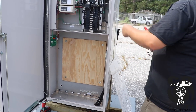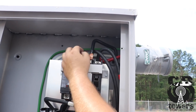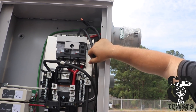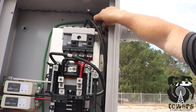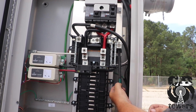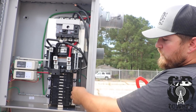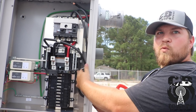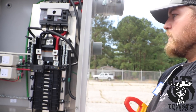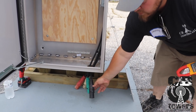Run them up, take them up to the side, and you're going to have to undo this. This right here would go right here. Undo that, push it out of the way — you can even tape it up if you want. Then put your black wire where the black wire was, your red wire where the red wire was, and then you have your neutral and your ground. If you notice, there's a green for ground but there's no green wire — grounds and neutrals share the ground bars, the bus bars. So it can be over here or over there; just because you don't see a ground wire doesn't mean it can't be hooked up. Then take those same cam ends and hook up each one and cut it on.